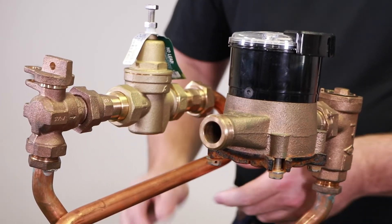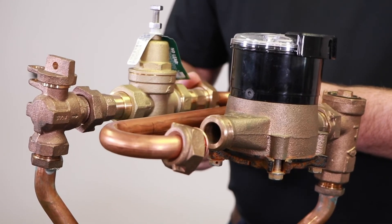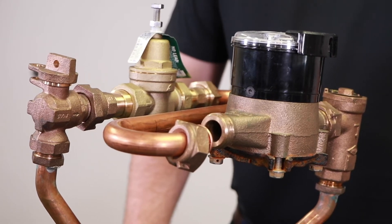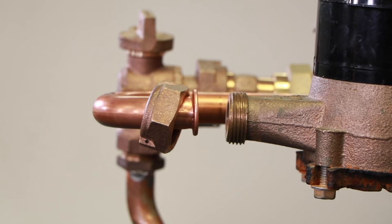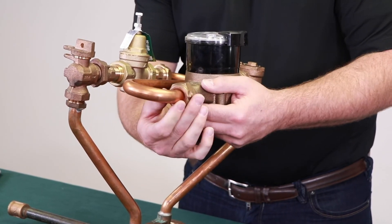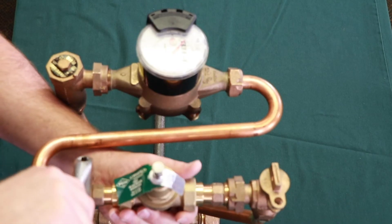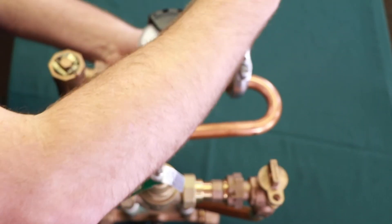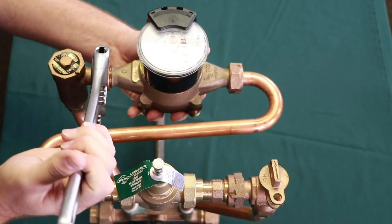Tightening down the meter and pressure reducing valve connection before installing the S-tube can cause alignment issues. Since there is a 4 to 5 inch range built into the setter, you can see it is difficult to line up the S-tube and the devices. First, it is recommended to loosely assemble both devices to line up the S-tube with the meter nuts. Once everything is loosely assembled into the tandem meter setter, begin tightening all the meter nuts in a uniform cross pattern until the meter nuts are tightened to make a good seal on the gaskets.